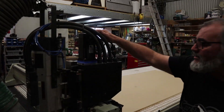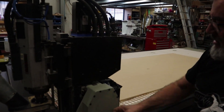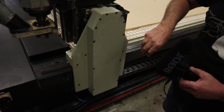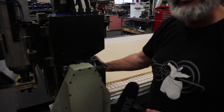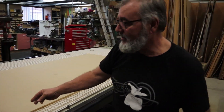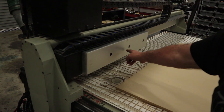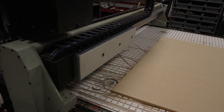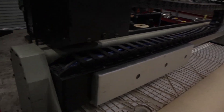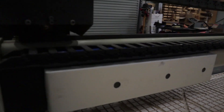If we go around the side here you can see the Z-axis motor. The Y-axis motor is sitting inside here, exactly the same motor, and down inside there hidden away is the X-axis motor. What I did with the drives is mount them around the back on the gantry — there's a box mounted on the gantry with three clear little windows so I can see the green and red lights if the drives have an alarm state.